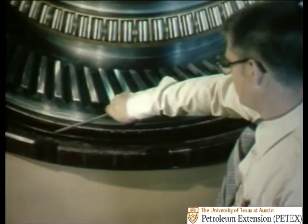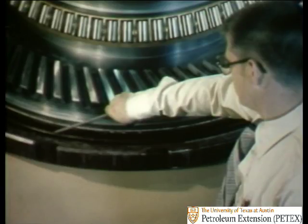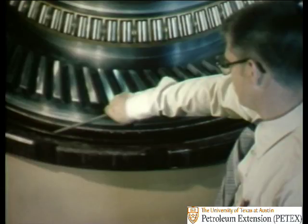Starting from the outside, the first thing you should be familiar with are the labyrinth seals. These are located between the top body cover and the main base. They are deep grooves which, with a little help from you, effectively keep mud and water out of the oil reservoir and thus protect the vital inner workings.